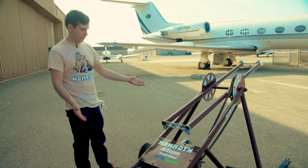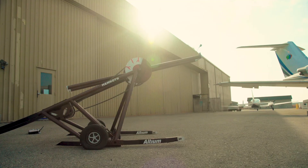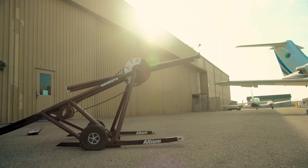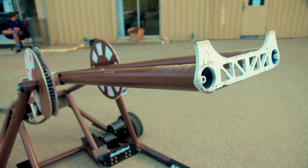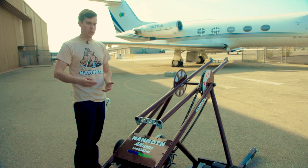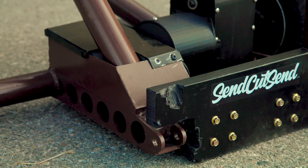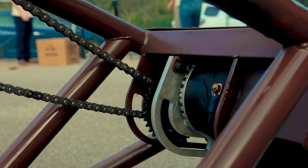This is Mammoth 2020. We're made primarily out of chromoly tubing — the same kind of thing that race car roll cages are made of. It's really strong, it's very lightweight, but it's also very compliant. So we go through a battle, we take a big hit, you might take some big chunks out of it, you might take some damage, but the structure of the robot stays intact.